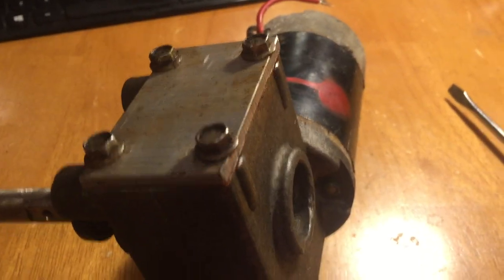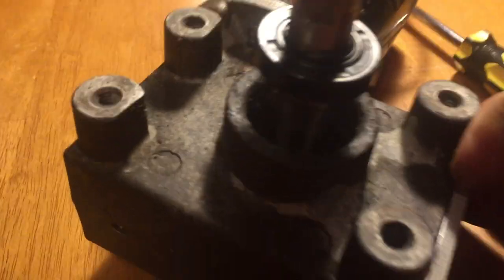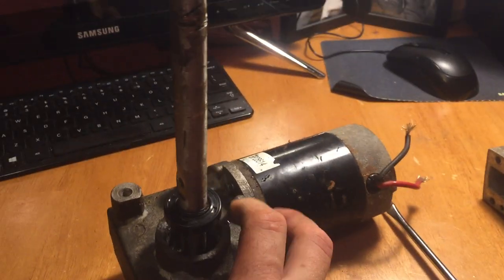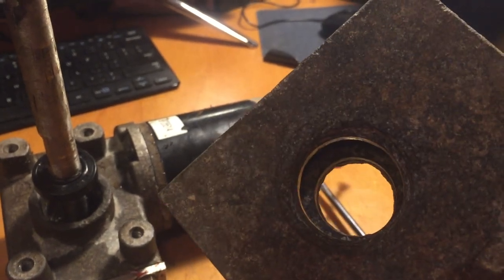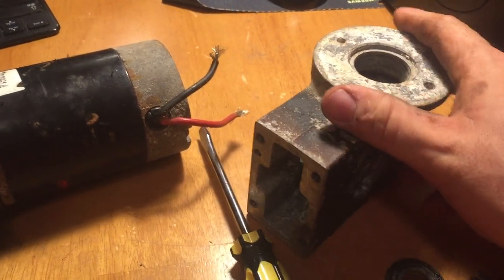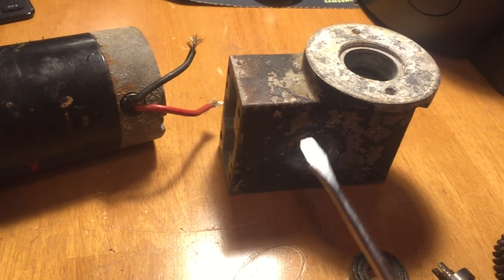You want to pop it through the gear that sets in the middle here. So it's this gear sitting down in the middle, through the shaft, through this gear — just keep hitting it. There's a bearing right in there and it's going to come out through that bearing, and the whole shaft is going to pop out. Once it does that, you're going to be left with this — your two bearings and your gear removed. Now on the chance that your bearings did not come out with your shaft and they're still in there, that's okay — you want to drive them up through the top. Push this one up and take it out.